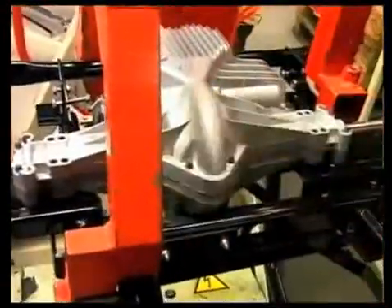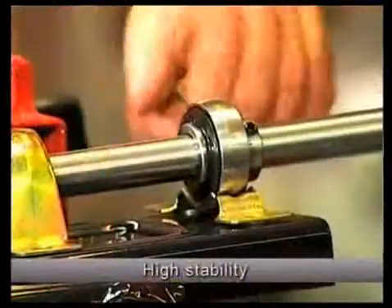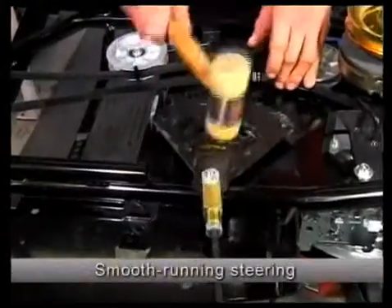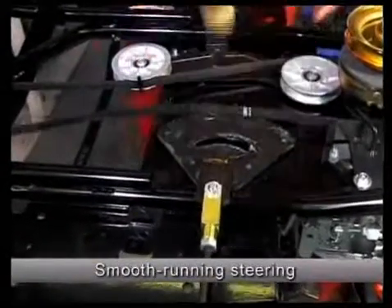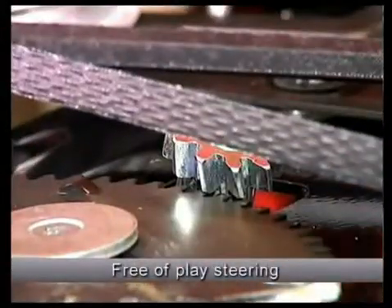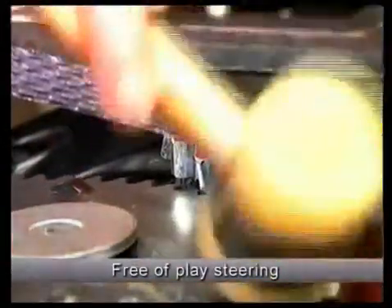The shafts of the compact gear unit have additional ball bearings. The center bronze bearings in the gear segment are self-lubricating. The helical bevel gear allows full surface tooth engagement of the gear segment.